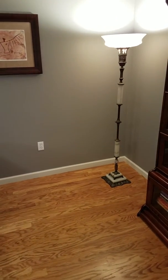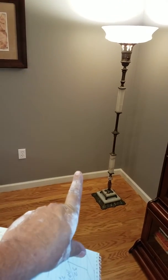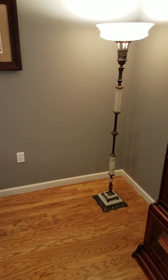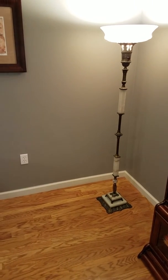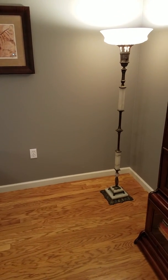We're going to have a register down here. You can't really see it, but there's a reference mark right about in here that started poking through the drywall. On the backside you're going to see clearly what you need to do — going to get a 32 by 14 grill in here.